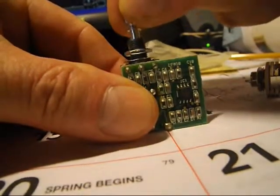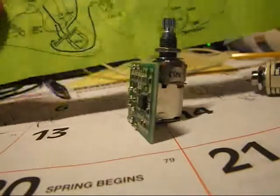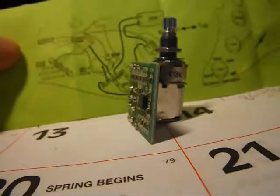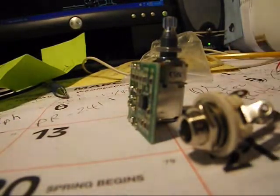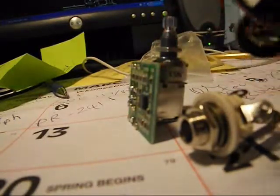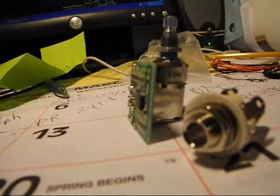It's got all kinds of little places around it, but it's got good instructions — a good little picture to look at, like dumb people like me. It shows you how to solder it together. They also give you a stereo jack right there — you've got to have a stereo jack — and this wires in for the 9-volt battery. There is a 9-volt battery; you have to get one and plug it in. But it works with regular magnetic passive pickups. It's a great little unit.